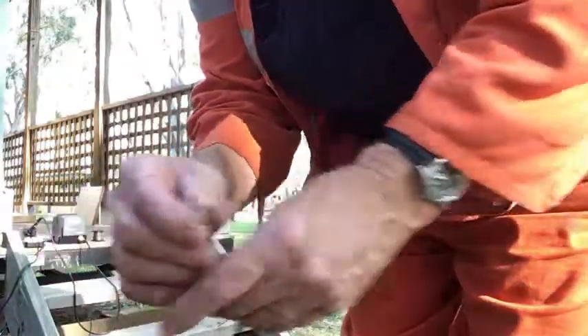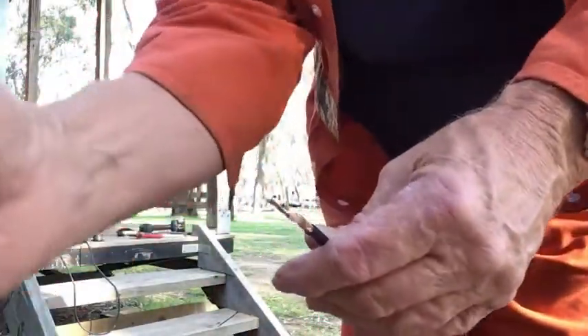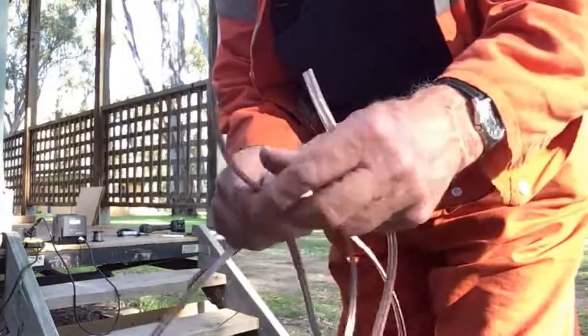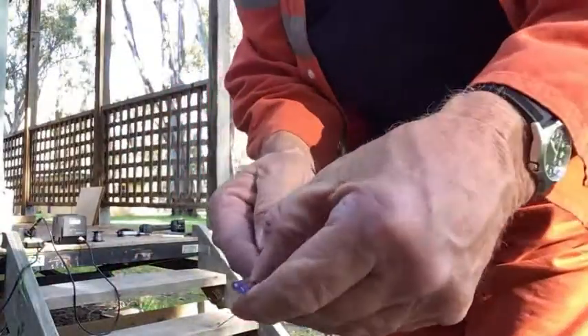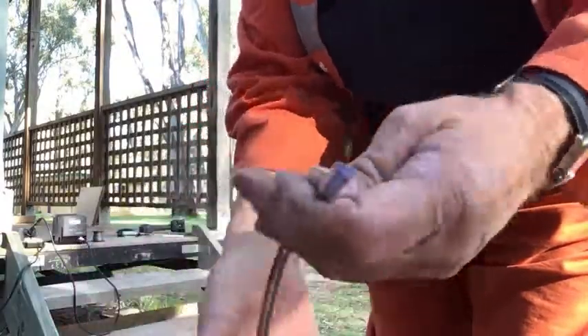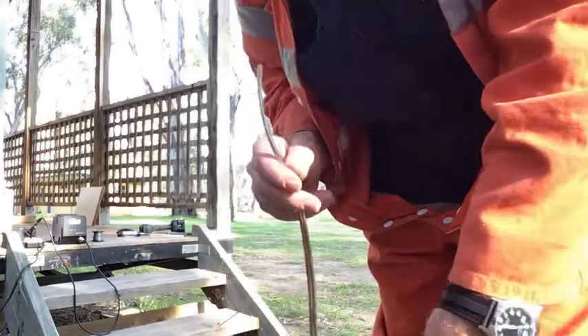See, I bared that cover back on the outside, bared the centre, just twist them together here. And when I make up my next little piece — my 0.9 stub — it'll just get soldered on there and go out for 0.9 of a metre. That's on each end. So here's my two lengths — this is speaker wire, you can use 300 ohm ribbon, whatever — and it's 0.9 of a metre each. What I do here is pare it back, take the insulation off at both ends, twist it together, solder it up. Each one will go onto one end of the antenna and the other one will go on the other end. Antenna's finished then.